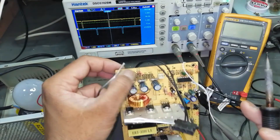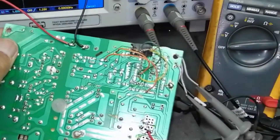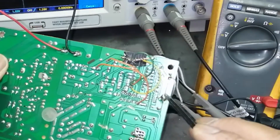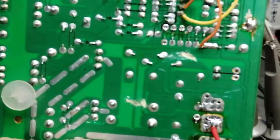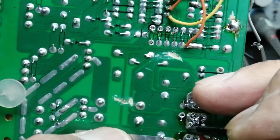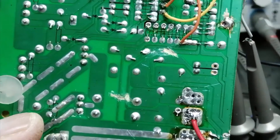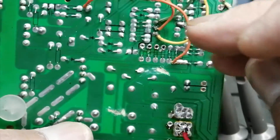This study will help you understand the function of this controller — 12 volt and 5 volt. I will connect the yellow wire at 12 volt. In the last session I removed the power-on command and connected a local ground, making a jumper from one wire to another. I disconnected the minus 12 volt sense line, the plus 5 volt sense line, the 12 volt sense line, and the 3.3 volt sense line — so we turned on this power supply.